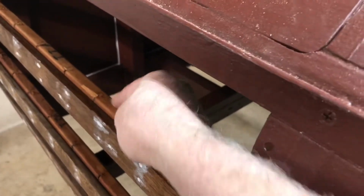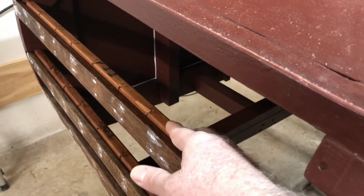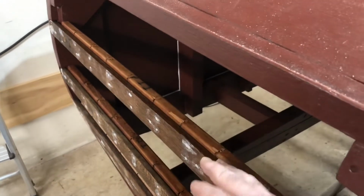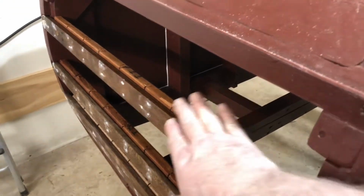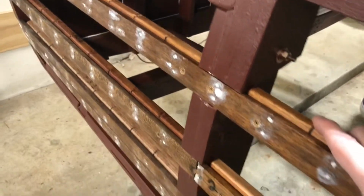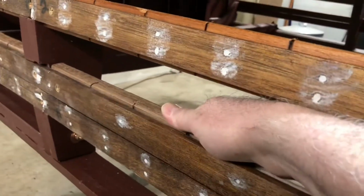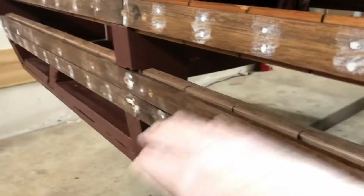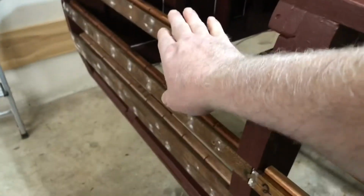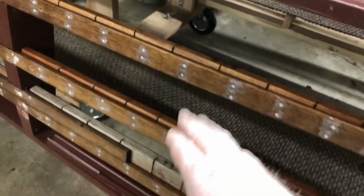So this is 3/4 by 2 inch mahogany. And I cut some slots into it to make it more flexible so that it could accommodate the curvature of these rails. There's not much curvature at the back of the boat, just some. And this set has 2 rails, so I just used wider mahogany lumber behind this set. So there's the first set, second set, third set.